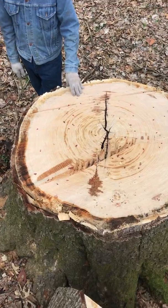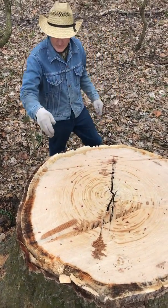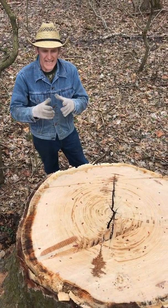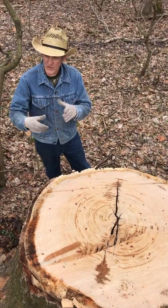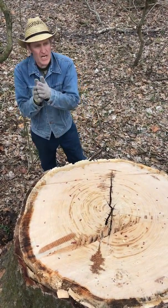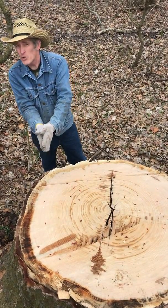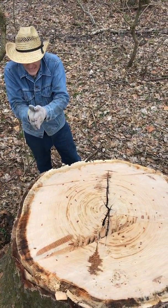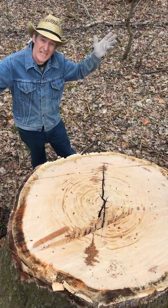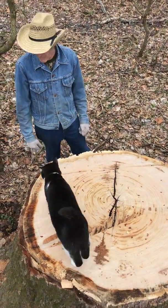It develops often something called ring shake, and what that means is if the tree is infested with a fungus — and if you smell the wood, it often has a poor smell if it's infected by that fungus — what will happen in the growth rings is the fungus will actually cause it to split. It may be three months or two years after a board is made, but it separates on those growth rings. So if you make a lovely dining room table, it could actually split right along that grain, and that's a major bummer.